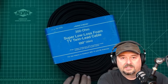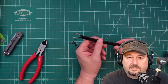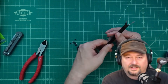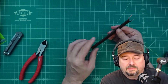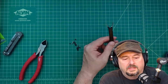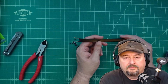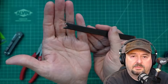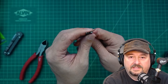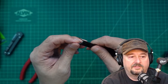What I want to do is cut a piece of this and open it up so we can see what the innards look like. After cutting a piece, the first thing I notice is that it is not very flexible, so this is going to be a very rigid structure. I want this to be an antenna used for portable operations, between 40 and 6 meter bands hopefully. The black foam dielectric is super sticky and it won't come off very easily.